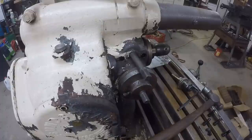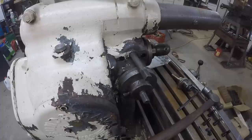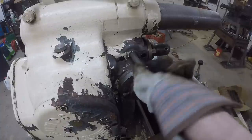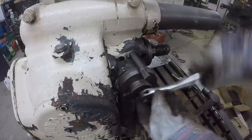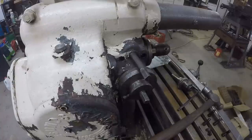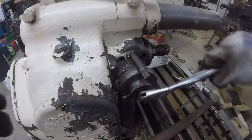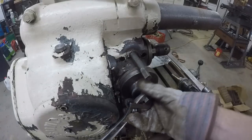It's fine, but I can't get the quill to go in and out - it's supposed to have about an inch and three quarters of travel and it won't move. The lock is free, the adjuster is also free, but it still won't move. I took bolts out of this cover and I'm going to try and take that off to see what I can see.